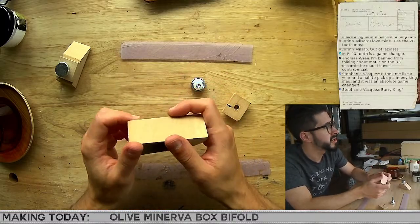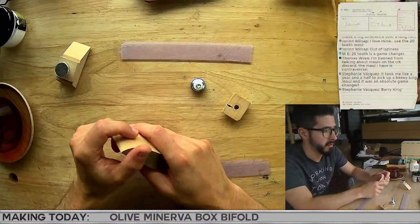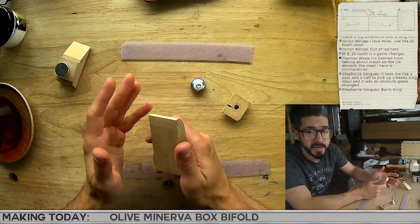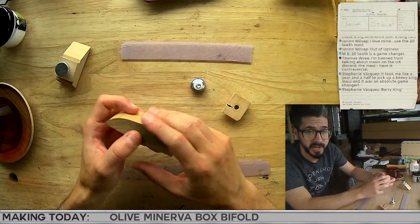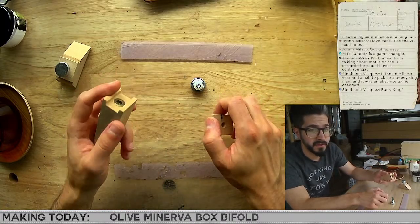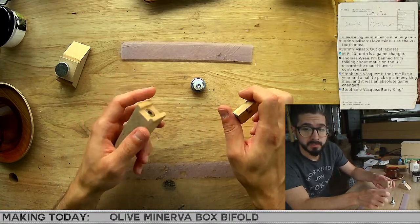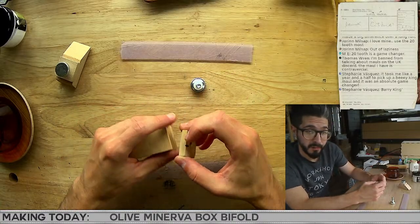We had the bamboo ones at my shop, but some of the nice pine ones are very good because they're longer and flatter. Anything flat can be a sanding block. It doesn't need to be one of these. I just like these because they're easy to attach the paper to. They have this little screw-in cap on the back. But literally, if you have a ruler in your house, use it. Put a piece of sandpaper on it and try it, and you will see that it is better.